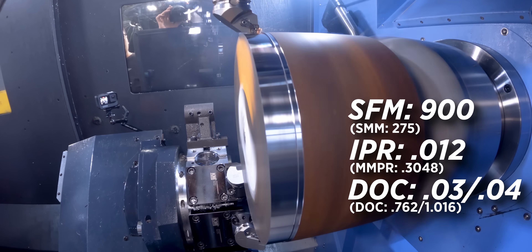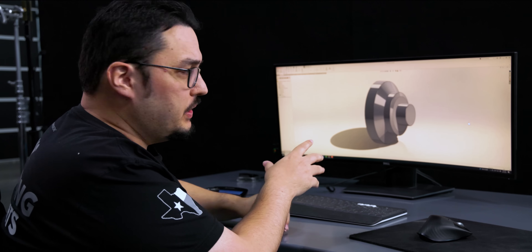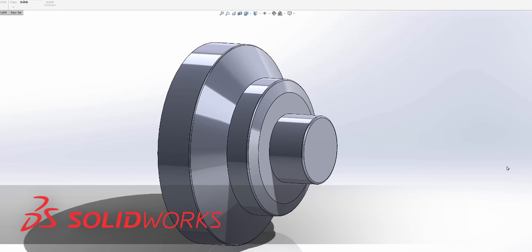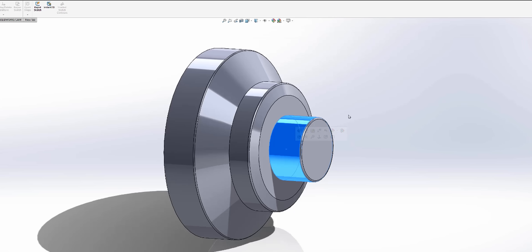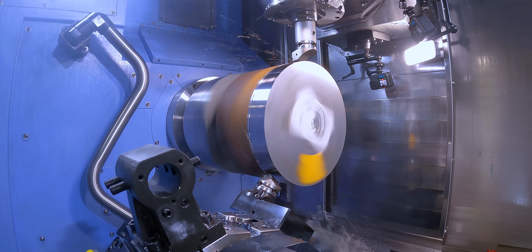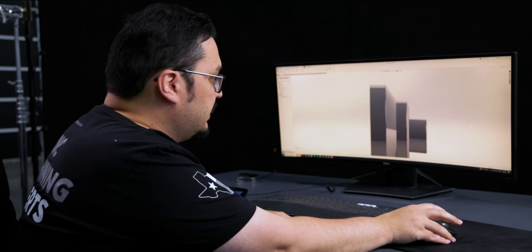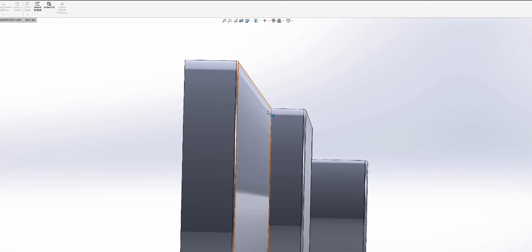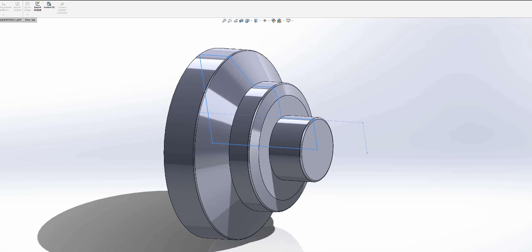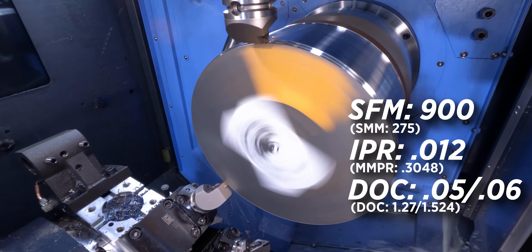Let me explain a little bit about the piece we're doing. I just wanted something simple to demonstrate the cuts. I have SolidWorks open — I drew a quick little 2D sketch and then revolved it to make this model. This is a 12-inch piece of 1045 steel with a 4-inch diameter on the finished part, so we're taking about 8 inches of material off. I wanted enough material on the OD to hold on comfortably, then I took it down in Z to remove as much material as I can without hitting the jaws, and gave it a gradual chamfer down to the other diameter.